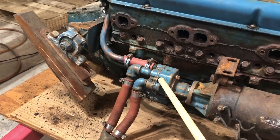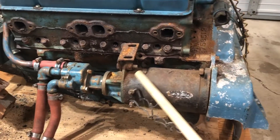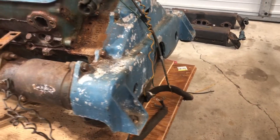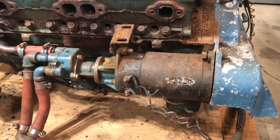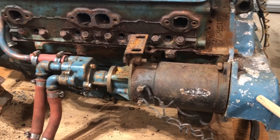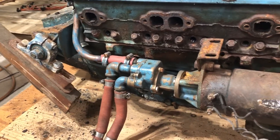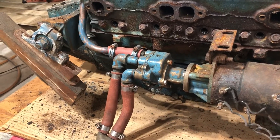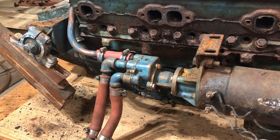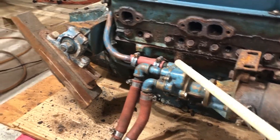This is the raw water pump connected to the back side of the generator, which is connected to the flywheel via a belt on two pulleys. This generator spins at about the same RPM as the engine. A pump like this has a performance curve based on RPM, and this pump at about 3,000 RPM will deliver between 7 and 8 gallons per minute through the engine per leg.